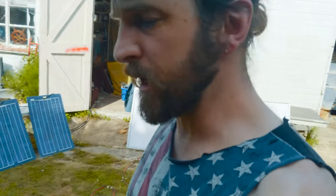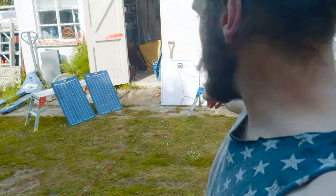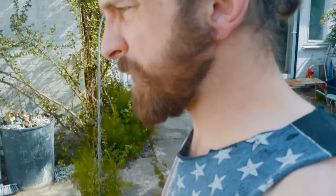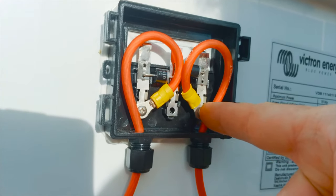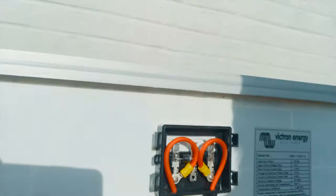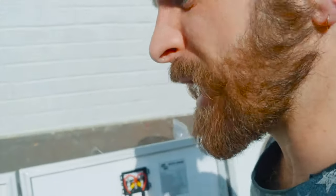I've got some fat wire - this is 8 AWG wire from Milestone Car Audio, it's proper oxygen-free silver-plated power cable. It's quite big because it's quite long. I want some flexibility about how these are wired up, particularly because the connectors are so fat. The connectors are too fat to get down the hole for the terminal screw. So we've just got this loose little loop - like a little heart - which gives some latitude for strain relief, and they get held with waterproof cable glands.